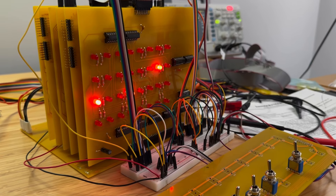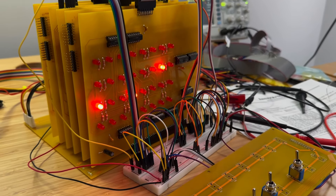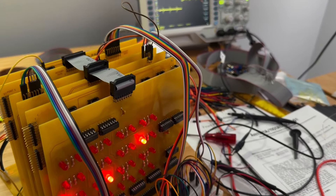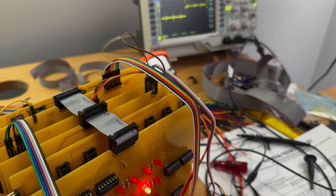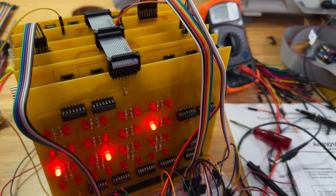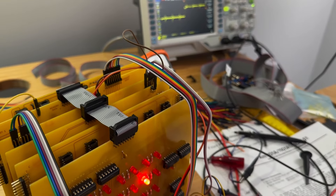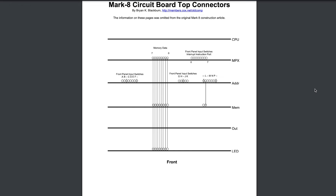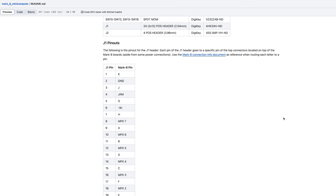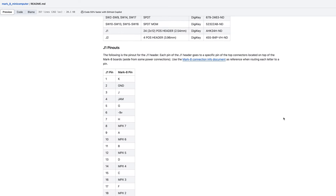Let's start testing this computer. Since we've already installed all the boards into the backplane, we can move on to the wiring. At the top of the computer, connect the LED register board, the memory board, and the input multiplexer board together using an eight-position cable. I created a simple harness using a 16-wire cable but only eight wires are actually utilized. Next, connect the other connections at the top of the boards based on the drawing created by Brian Blackburn. If you're using the switchboard that I designed, you can utilize the GitHub documentation linked in the description to determine where each pin of the J1 connector goes.